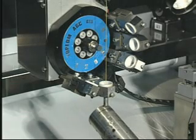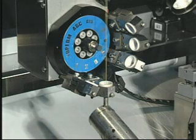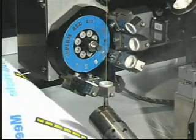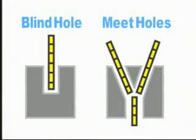TSH-600V also drills blind holes on all conductive materials to an accuracy better than 0.2 millimeters. Multiple holes in the same or different sizes can meet inside of the workpiece at different angles and different depths — all in one part can be programmed automatically.